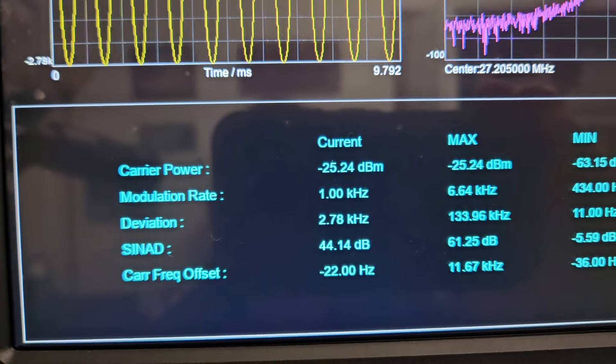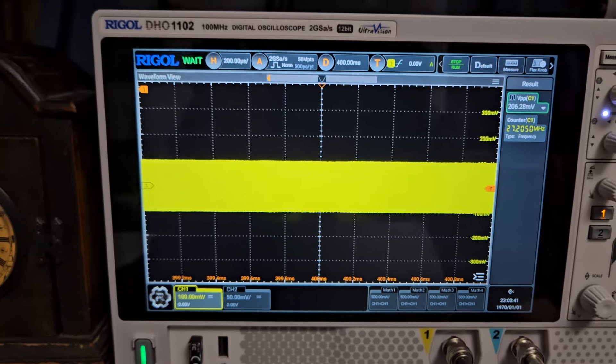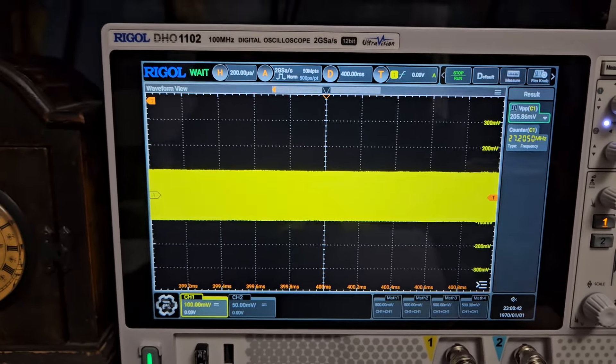Here's your AM on low power — it really ramps up and then throttles back. The inside of the waveform looks really good. Up on the spectrum analyzer with a 20kHz bandwidth, you've got 10kHz on each side — it's looking really good for AM low power. Here's the high power modulation for AM — there's the carrier right there and there's the modulation.